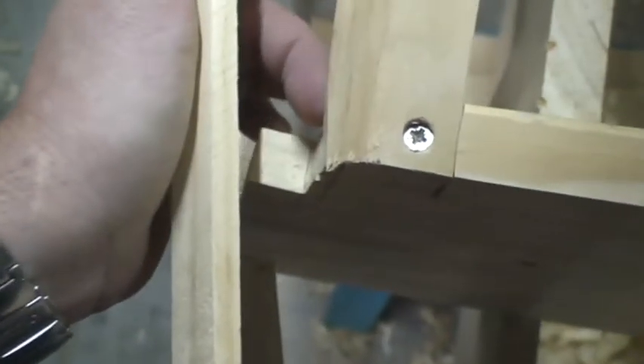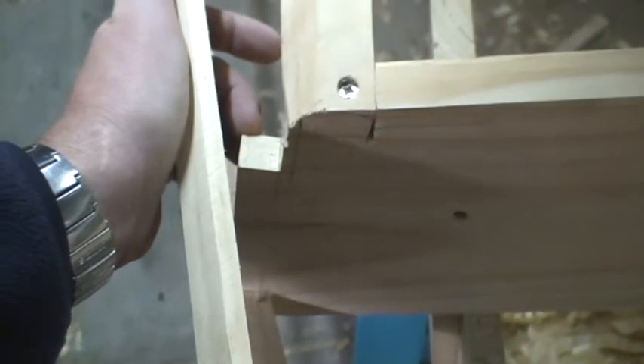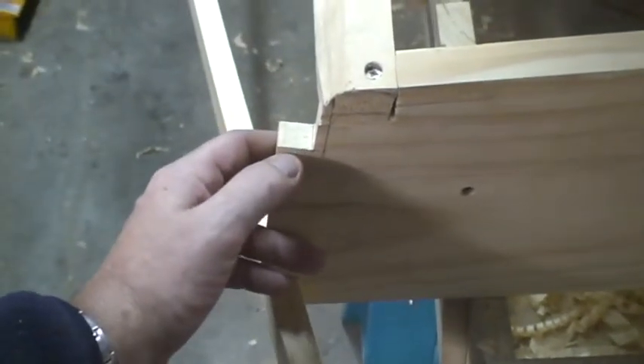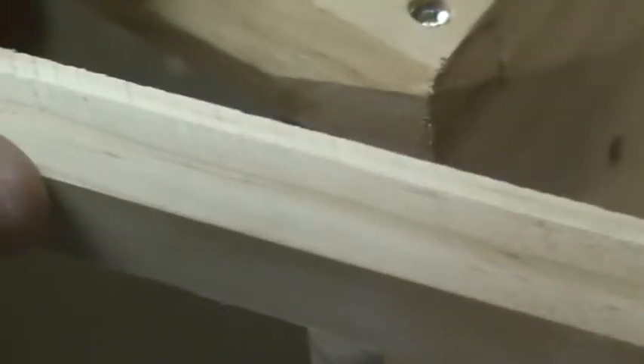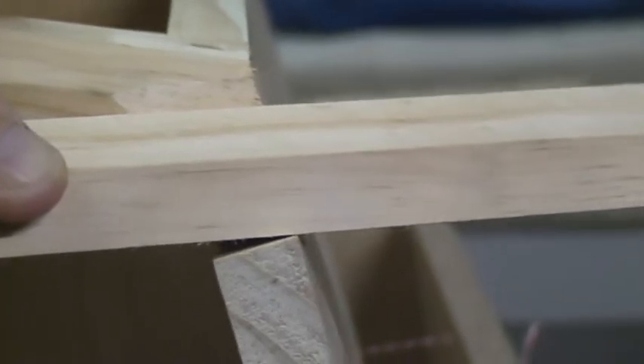We don't want to move these lines here because that's exactly where we want it. You can see on the front side of the bow where I've just drawn a line 6mm away — that's how much I need to move the front across. We possibly need to move this down a little bit as well, but we'll deal with this bit first and then adjust once we've got the chine sitting nicely to that mark. As you can see we've got that cut away at the front now. Moving the chine across, it's now sitting in there, and you can just see the angle that needs to come down. We'll measure that at the back and take that off at the front.